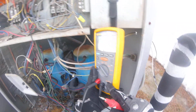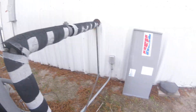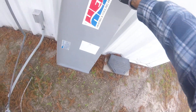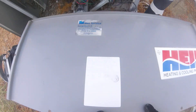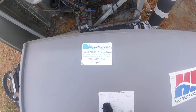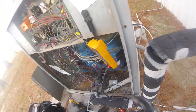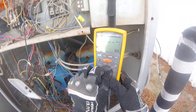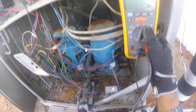Now I'm going to check the insulation. On the insulation test, you've got to find out your voltage — you always want to double that. So I'm going to go to my nameplate right here and find my voltage. The rated voltage is 460. It's 460, so I'm going to double that. Double 460 is really 1,000, but first I'm going to go at 500 to check my insulation and see if it even takes the 500.